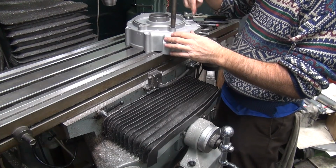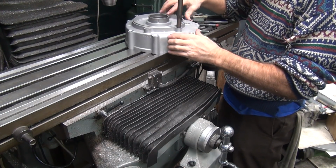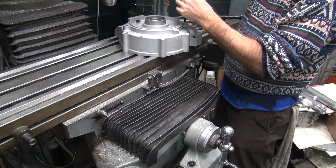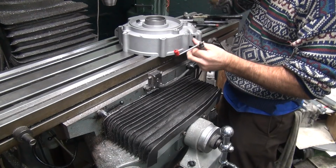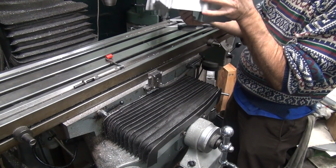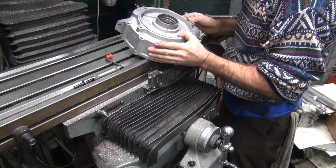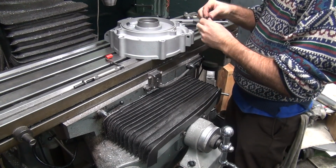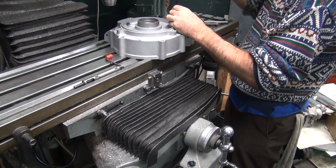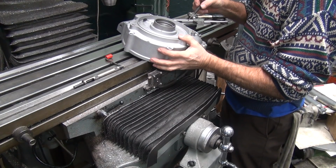Unless you luck out and the grease you used to pull it in stuck to the flywheel and rotated it, came back up. And then you lucked out. That don't happen very often though. If you lose that tang, you're done. You have to pull the whole motor apart. It looks good. Roll the dice and rev it hard. See what kind of damage it does before it comes out?